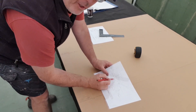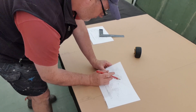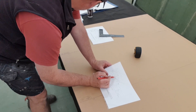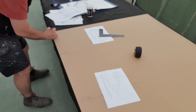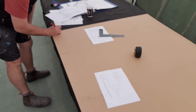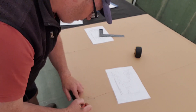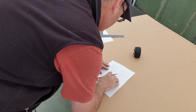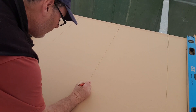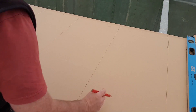From the first station at 820mm from the centre line, I've worked out we've got to be at 2500. At station 2400 I've got to be 100mm up, so I've measured up from the bottom 100mm — that's my first intercepting point. Then at station 2000 we're at 125mm — there's that point. Then 177mm at station 1500, and 282mm at station 1000. So we're starting to see a curve developing, which is our wing plate shape up towards station 500.